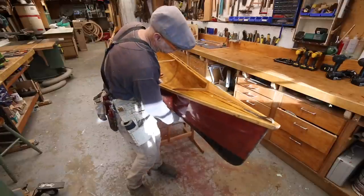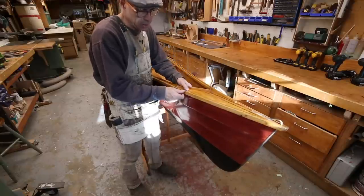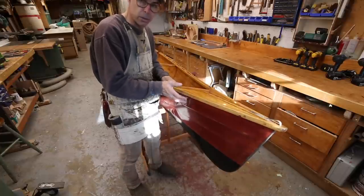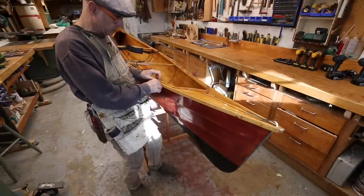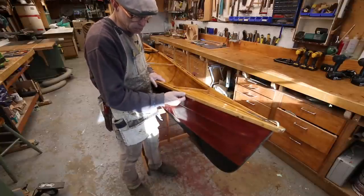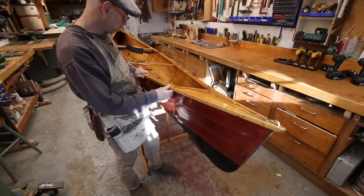One of the other little details I would do differently now is put a much broader molding on this rub rail here — these are just very small quarter-inch round overs at best. I would definitely put a heavier round over, maybe even a full half-round or some other ovoid shape. These are just a bit sharp and as a result you get a lot more wear and tear on the edges. The varnish is breaking down there, and ash is particularly bad for turning black once water gets into it — the only fix is taking it right down to bare wood and sanding out that color.